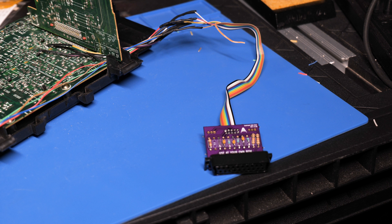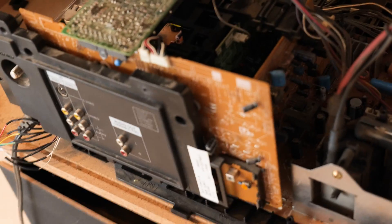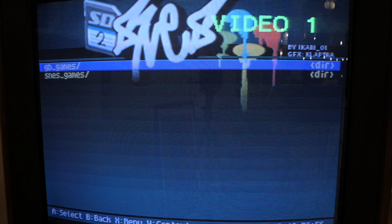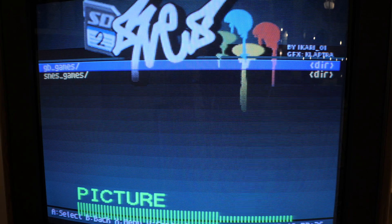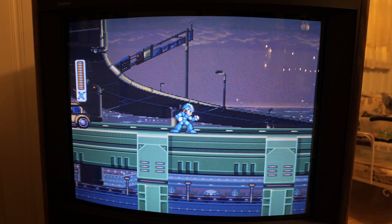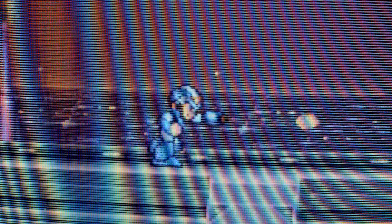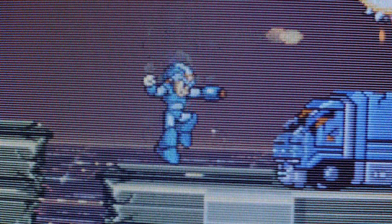I reassembled everything, put the whole cage of boards back together, and before going any further with the reassembly I gave the system a test. I connected my SNES via SCART to the new connector, and by some miracle the thing works on the first try. It looks a tad dim, so I went to the menu — and yes, the menu works in this mod — and cranked the picture setting all the way up. That looks perfect. I tried out some Mega Man X, and holy cow, this looks awesome. The fuzziness and the color red smearing is gone. It looks sharp but doesn't look too sharp like some of the late-stage CRTs — just very natural and easy on the eyes, and the colors are more balanced, deeper, and richer.